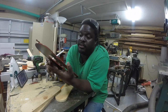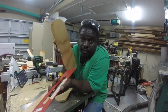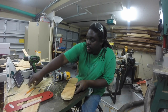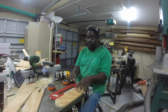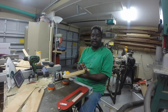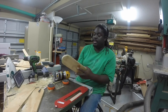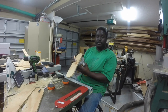You don't have to be exactly accurate with this either, because if you were off a little bit you could sand the top of your zero clearance insert, which is something I'm going to do before I'm done. I changed out my router bit — I went from a bearing-guided flush trim bit to just a straight cutting bit — and I also used the template once again to determine how much material I needed to relieve from the bottom side of this insert. I put both of them on a known flat surface — the top of my table saw. Then just scribe a line, and once you have that line, bring it to your router and use that line to set your depth of cut.